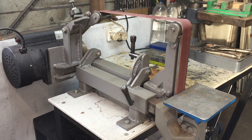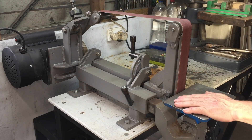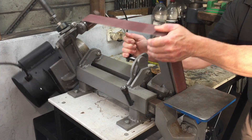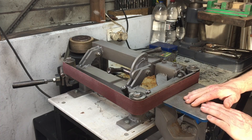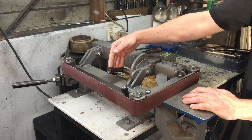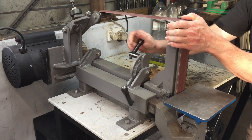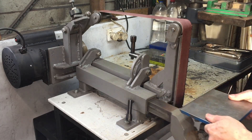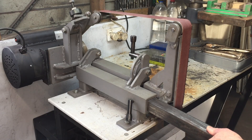The good thing about this design, unlike some others, is that it's a tilting grinder — when you tilt it, the table stays still. You can tilt it around 90 degrees and the table remains stationary, so you can put your work on it and have horizontal grinding. That's controlled by a lever I made, rather than the typical nut and spanner, just to make it easier. The table can also be totally removed and replaced with other attachments.